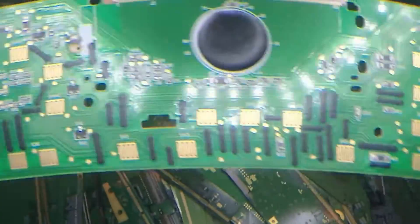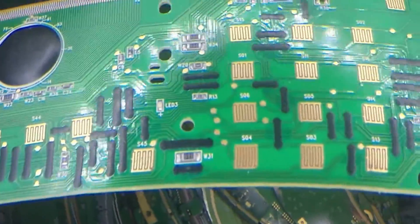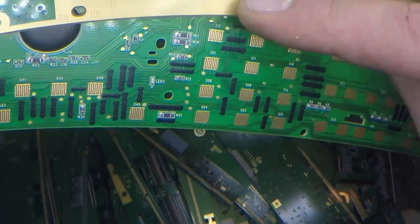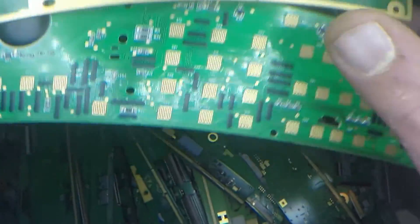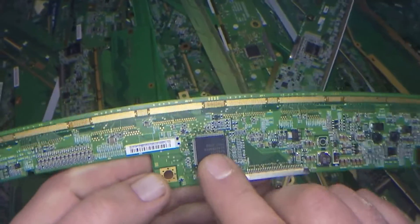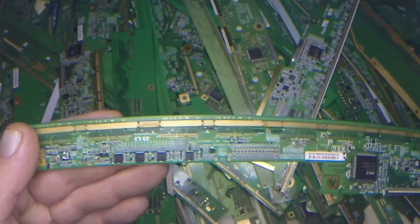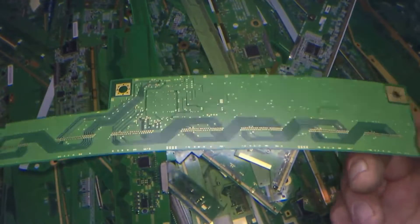Here's another older gold plated keyboard. And as you can see, this is dull. It's still gold, but it's dull. This is shiny gold - it's definitely plated, and that's flashing. So you can pretty much safely say that all of these finger strip boards, it's gold flashing and not plating. They'll have pins inside that will be gold plated. If there's gold in the IC chips, it will be gold plated - it won't be gold flashing. The MLCCs will still have your palladium and silver. But yeah, just a lower grade of gold, but still gold.